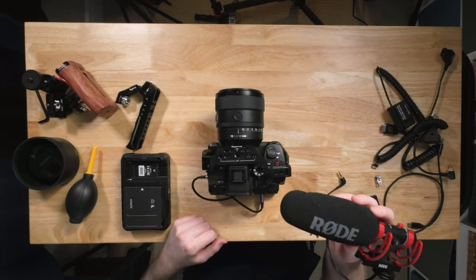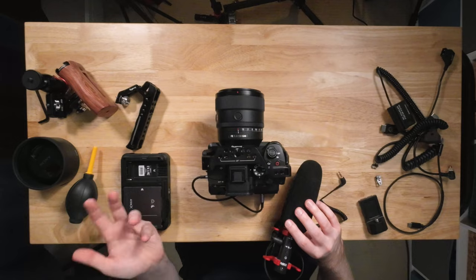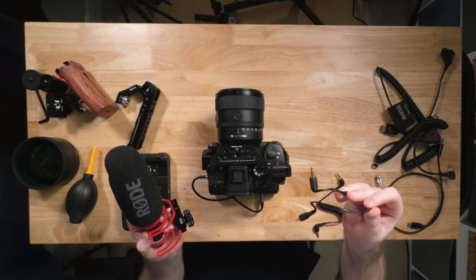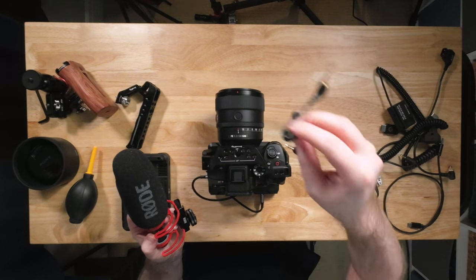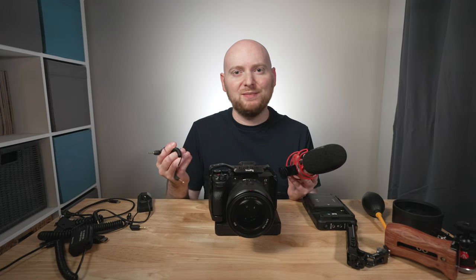For audio on my Sony Alpha mirrorless cameras, I'm a big fan of the Rode VideoMic NTG. I have a separate review of this mic on my channel. It ensures you get much better than scratch audio — I use these NTGs for a lot of my talking head videos, including boomed above me right now. They offer excellent audio quality for the price, which is around $250 US. When you get the NTG, it comes with a TRS-TRRS 3.5mm cable, but Rode also makes the SC2 coiled cable for about $15. It's TRS only, so not ideal for smartphones, but great for cable management as we build the rig out.